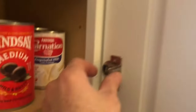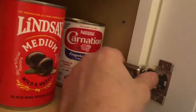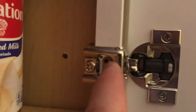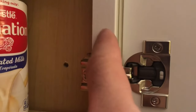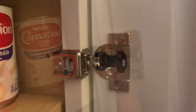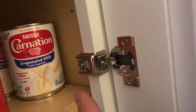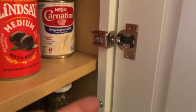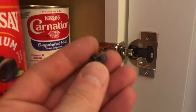What I did is unscrew the main screw, and there's a few screws here. The one that's deep in here is the one that's connected to the cabinet. This one right here slides your door left and right. And this one, if you screw it counterclockwise, it will make the cabinet go this way — that's for adjusting these. If your crack doesn't look flush or if your cabinet is coming in or out, that's what these adjustments will do. But this video is about hinge restrictors, so we'll get back to the topic.